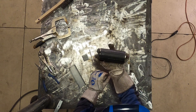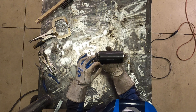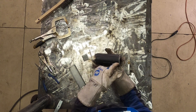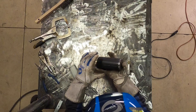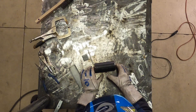What you might want to consider doing is, instead of welding one line adjacent to the other, in order to distribute the heat evenly and reduce distortion, weld on one side and then turn it over and weld on the other side. That should really help decrease distortion. So now that our lines are drawn, I can just trace my line.